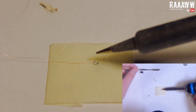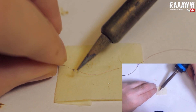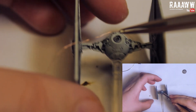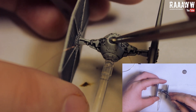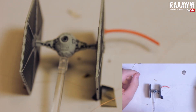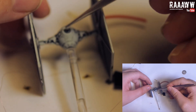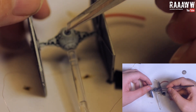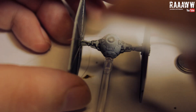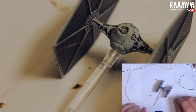Take a little bit of solder on the soldering iron and just dab it on the LED. Make sure that you do not use too much solder. Solder the second thread to the other side of the LED. Make sure that the LED still fits in the chip's exhaust — if you use too much solder it might not sit well. If you use hot glue or this glue in particular, it's easier to put glue on before placing the LED. And here you can see that it still works.